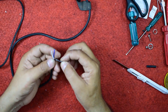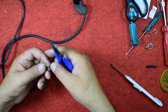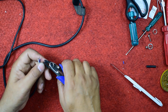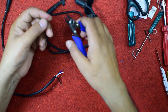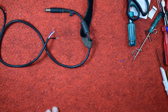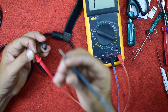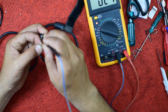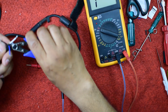In this cable we are getting three wires, so let us check which should be positive and which should be negative, and which one is the standby voltage. In a power bank we do not need standby voltage. The red one is positive and black one is negative. There is some doubt with the third wire — now check: black one is ground, white one is positive, and this blue one in the middle is the standby voltage. So we need only black and white. Cut this extra wire.